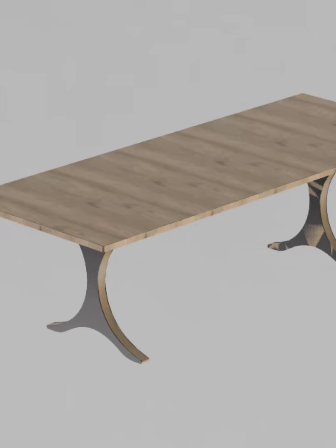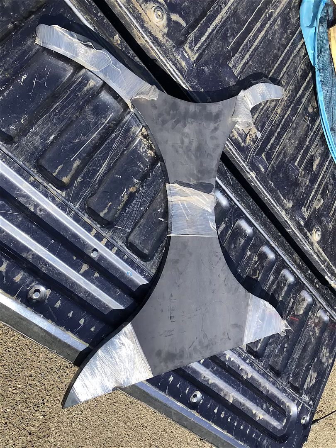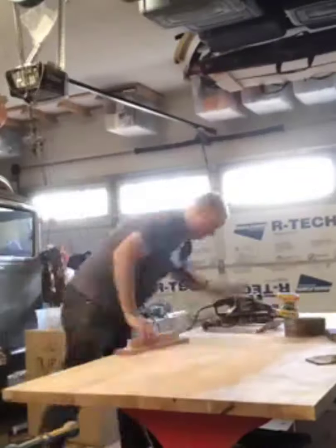I knew I wanted some wine-glass-shaped legs that were going to be a glue-lam of steel on each side with a solid oak core, so I went ahead and drew this up in Fusion. The first step was to make sure the legs were the right size and were going to work with the table. I used a laser to cut out a mockup and set that up to verify. It was now the fall of 2018 — we were hosting Christmas dinner — so I ordered the steel and had a local manufacturer laser-cut my design.